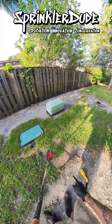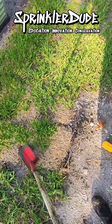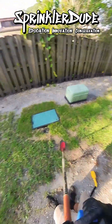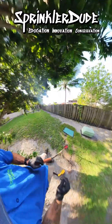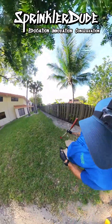I may end up cutting the wires here so that I can track back that direction to see if I lose signal over there, and we'll see if we can get this wire up and running. At the end of the day, we're going to get this up and running so that that zone down there will work, but we're going to propose to run a new wire because clearly this wire is extremely shallow and it won't last very long. We'll get this running for them, but we're definitely going to propose a new wire because this won't work out.